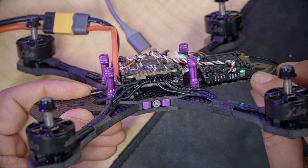How does the video transmitter have 3339.10 on it? That's the latest possible firmware, the beta firmware. How did this video transmitter come out of the box with beta firmware on it? That confuses me, but it does explain why the firmware update didn't work. Walksnail has a feature that prevents you from rolling the firmware back to an earlier version. So 3339.8 is on there. I tried to flash 3237.10, which is an older firmware, and therefore it didn't take.